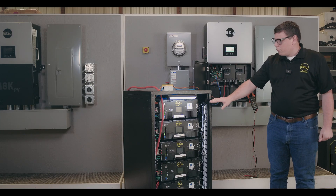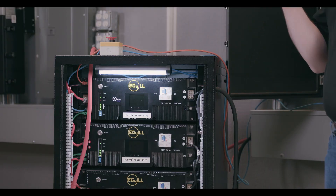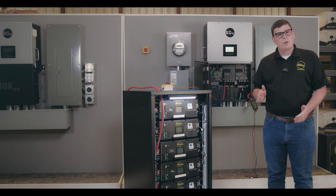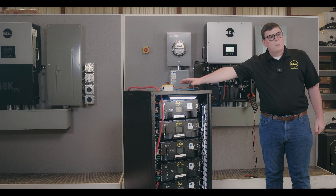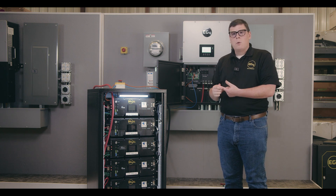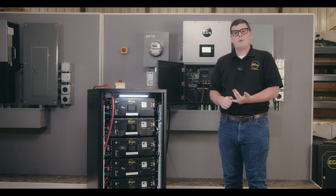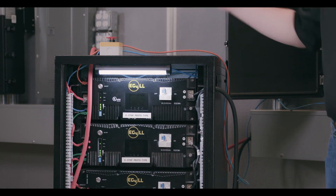This new version of the server rack battery looks very much identical to the others, but it has a rapid shutdown capacity. This is where we believe we are ahead of regulations — when you use the rapid shutdown remote button with your hybrid inverter, you will not only shut down the solar DC circuit, you will also shut down the inverter circuit, and every battery individually will have its breaker tripped when I hit this red button.